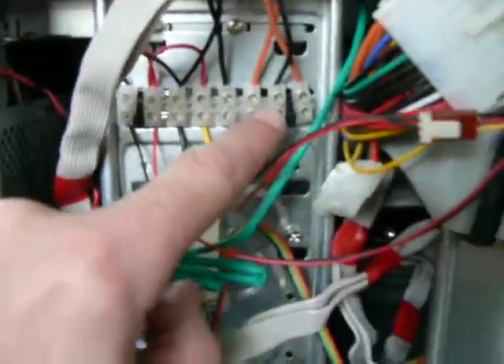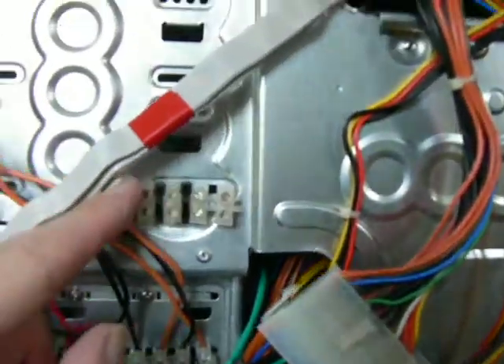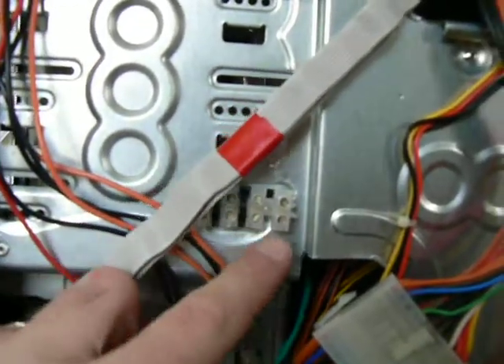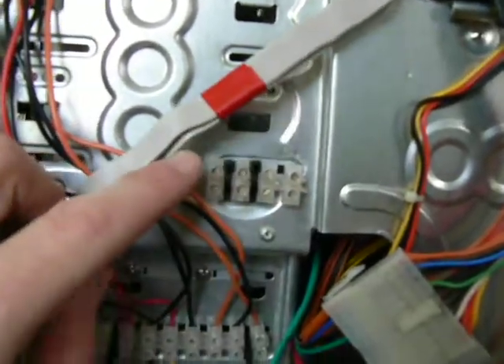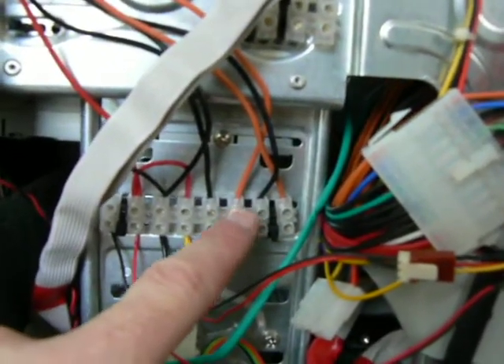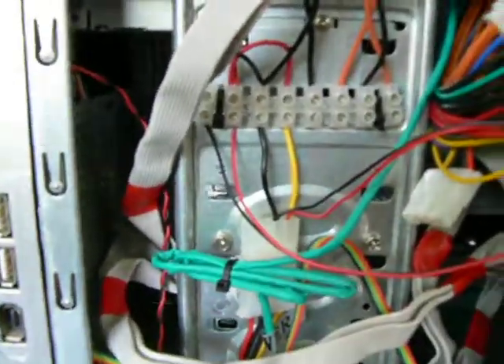There are some interesting other voltage options on here too. I've mentioned the 7 volt mod — if you take your 12 volt as positive and run your ground through the 5 volt rail, you get the difference, which is 7 volts. Also, if you connect 5 volts as positive and 3.3 volts as your negative, you get 1.7 volts, which is good for powering red LEDs as they're lower power.